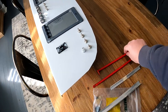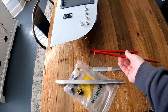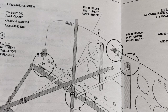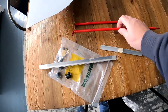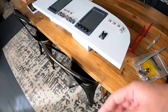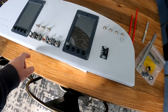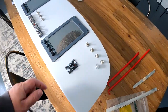These are weldments with a squished end, meant to go on the other side — pretty sure they're 4130. Keep in mind I have a Kitfox 5; the manual shows them at two different lengths and shows their location. They connect to the top hole on the aluminum angle. I'm a weight freak and these seem a bit heavy, so I'm going to mock up both options using aluminum tube with squished ends. I'll put the instrument panel in the airplane, verify everything's where I want it. Throttle and mixture control are not on here — I'm going to do a sub-panel down below so those don't have to be disturbed to pull the panel out.